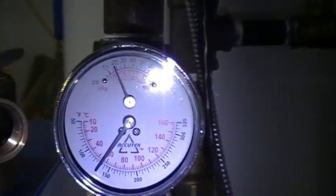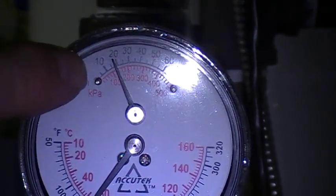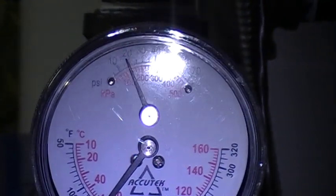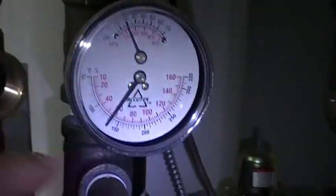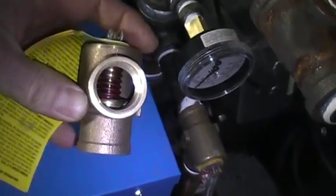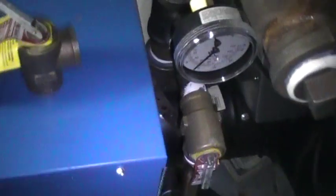So just check your pressure — it's up top here in the tridicator. Right now it's just under 20 pounds, which is right for working pressure. Down below is the temperature, and there's your relief valve. Safe practice and the only way to go: never plug your relief valve. Thank you, have a good day.